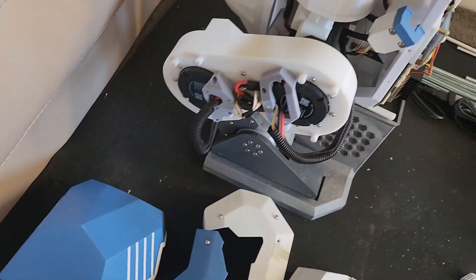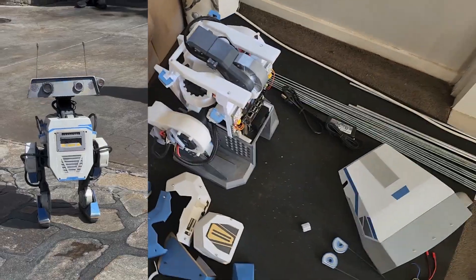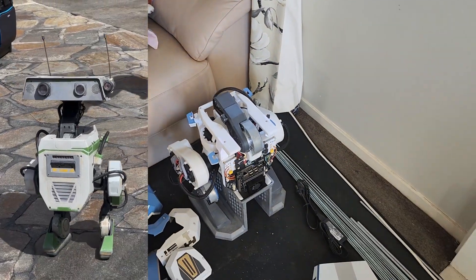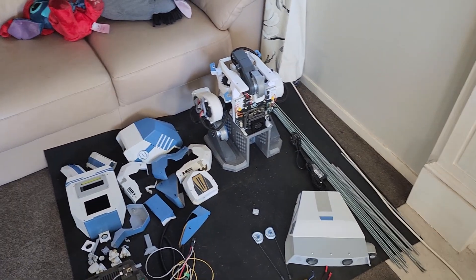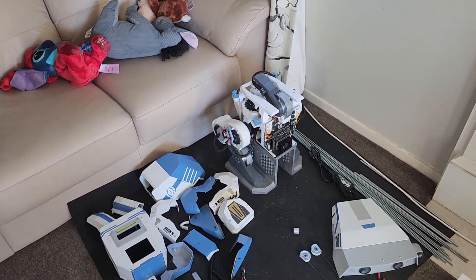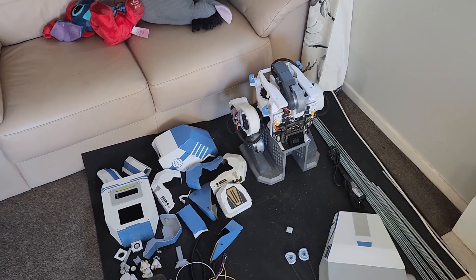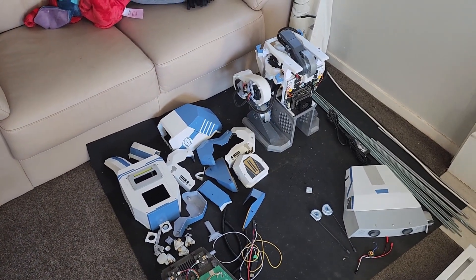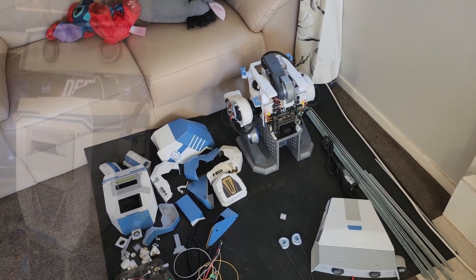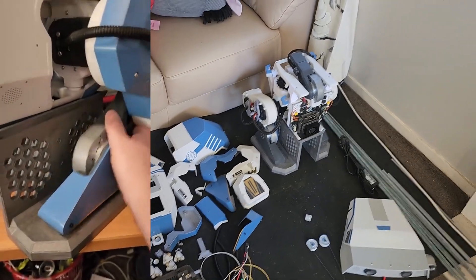These actuators will all be able to walk, but you have to teach it to walk. Strapped on the front is an NVIDIA Jetson, so you can take this into a simulator, try to teach it to walk there, and then do sim-to-real transfer — that's the area I'm having to study hard. We've made some progress but haven't even finished the electronics yet. There are a lot of people trying to do the same thing, many further ahead than me, so in some cases I may follow along with others, and in other cases press on with my own approach.